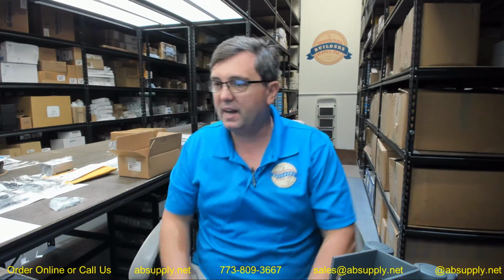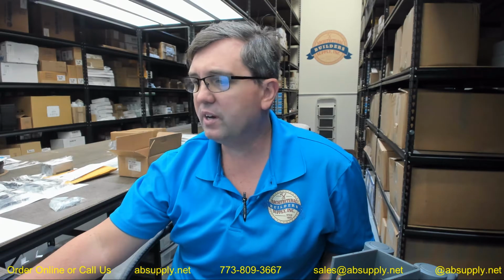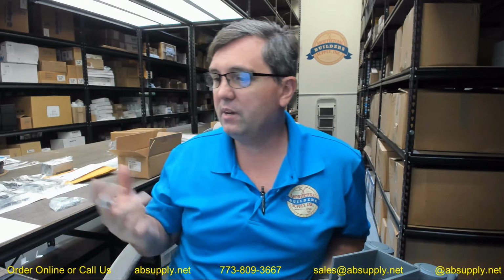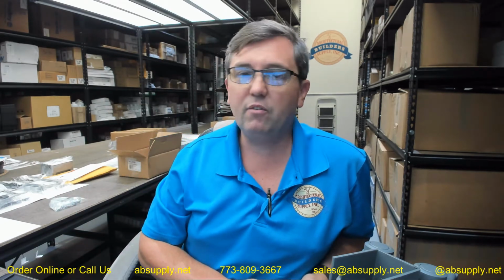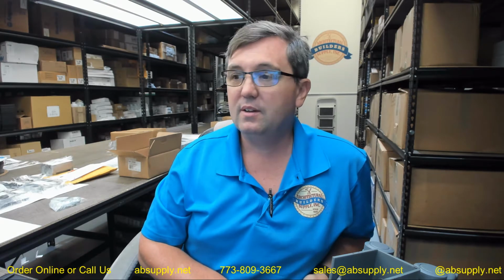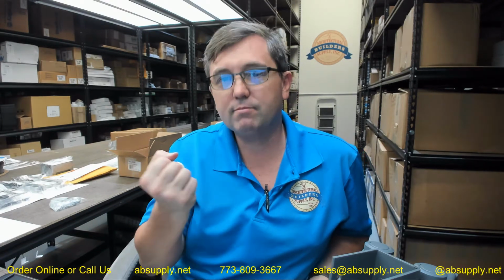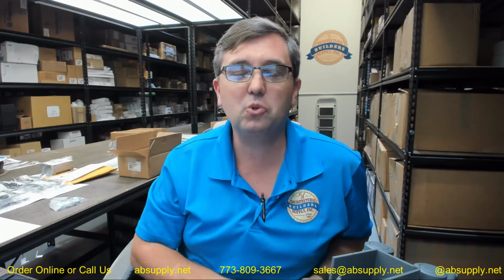Be mindful of that. However, the door thickness change, they've probably not tested anything of that nature with an unusual door thickness. Okay, they are saying that your minimum height is 7 foot on these doors. I think the reason they give you a minimum height is because if you try to install 3 of these onto a door that's 4 foot tall, you could probably expect some really aggressive, uncivilized behavior out of that door, because there's too much chutzpah for the size door that you're hanging.